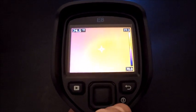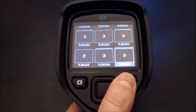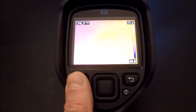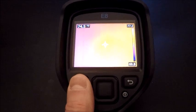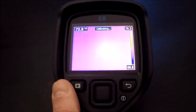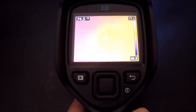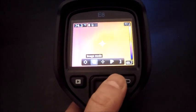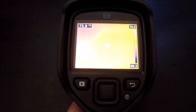Our playback button is here to look back on our captured images — what's saved on the camera. Tap this button and it will bring up what you have stored, both visual and infrared images. If you hold that down for longer than a second, it's going to perform a non-uniformity correction — a NUC of the camera, an instantaneous calibration. Over on the right, if we get into any menu options, that's going to be an escape key or back button to return to the main capture screen.